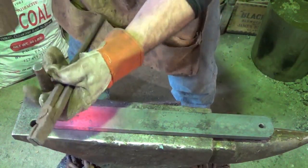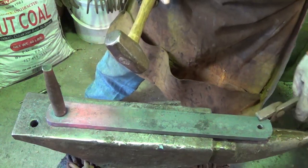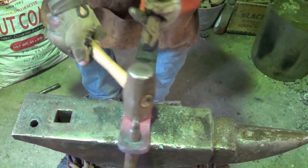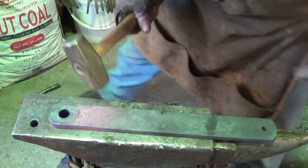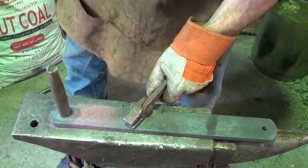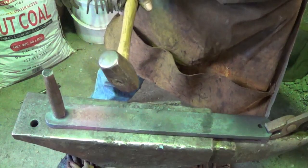the wrist pin there, I'm putting a little taper on it with another punch. Just a little bit to give me a little bit of room to play if I need it. Come on now, you're fighting me, camera. We'll do both sides. And that way if I have to tip in a pin from below, I got a little more room to play with on the outsides. That's the hope anyway.